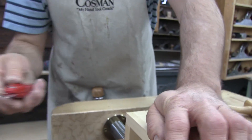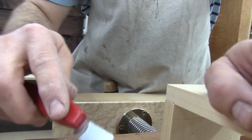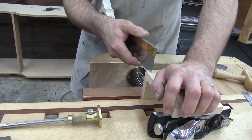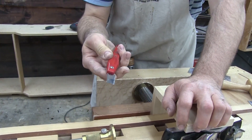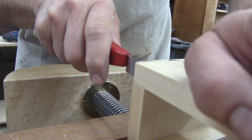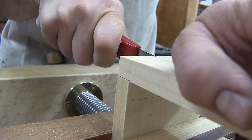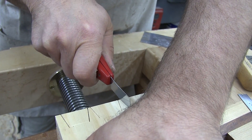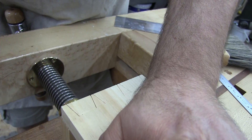I've got another little tool to show you — it's a blade that we're going to get made so you can replace the blade in your dovetail marking knife. Instead of having to go in there and hold the saw blade, which for some folks is kind of hard on the hand, what we were doing was dropping the saw blade in and dragging it through. Well, if you want something a little bit easier, we soon will have a little replacement blade that will go down that kerf, and as you drag it through, that will give you an exact precise mark transferring the tail down to the pin board. In this case I'm doing the right side of each tail, then I've got an offset in the opposite direction.